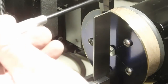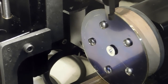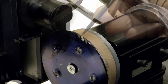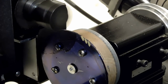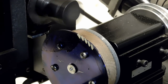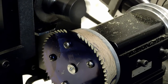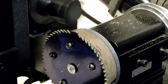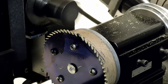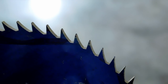We've got the lathe set up the same way as before, bit centered, and now we need to put our 15-degree undercut in there. I'm checking for the depth — looking on top of the tooth for that blue, just so there's just a whisper of it. If you want to know more about how I do the gear cutting, make sure to look at the previous video I made on gear cutting — I won't repeat it all here. Here we go, coming up on the end — there's the finished tooth formation on the large of the two escape wheels.